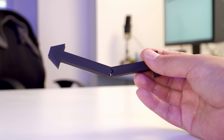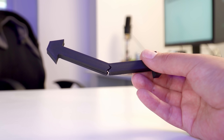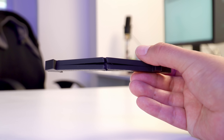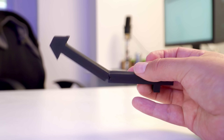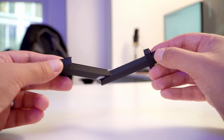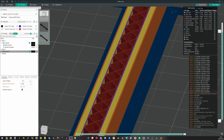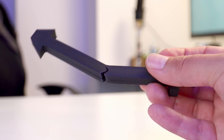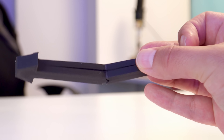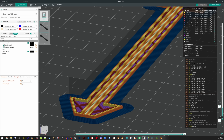If we look at the remains of our test parts, the normal part with perimeters and infill broke relatively compactly along a single plane as viewed from above, but on the sides it absolutely sliced through all the way along. On the hollow one, it sort of sheared off diagonally without that much damage spread. When you bend something, there is a mix of forces — you're tensioning one side and compressing the other. Tensioning our normal piece with its right angle between perimeters and top and bottom layers concentrates forces in the corner, and also in that narrow perimeter structure, pulling the sides apart and causing a rip along the layer line. On our edited internal geometry model, we don't see much of a layer line rip, even though that is the weakest structural part, because of the heavily reinforced corners.